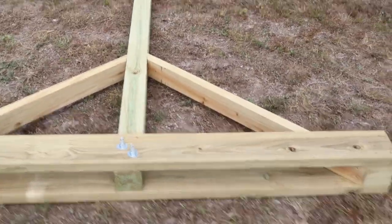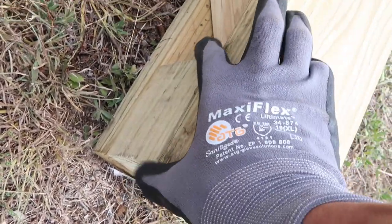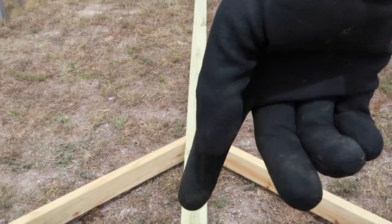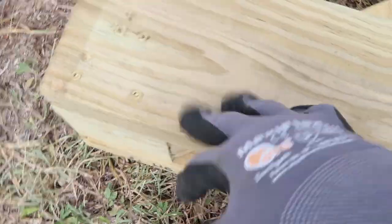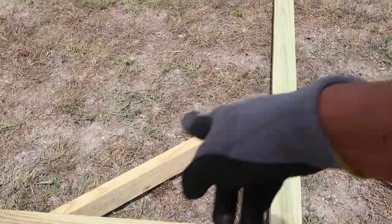So like I said, these are the main bases that we built at home. Two 2x6s that are each 6 feet long. And then we have a piece of 4x6. I think it's like, I don't know, 4 inches wide, that we cut off of the main top beam and placed on either corner. And then we have a 12-foot 4x4 going up the middle. And then we just placed the wood screws, 5 of them here, 5 here, 5 there, and then 2 lag bolts through the 4x4 in the bottom. Then, like I mentioned, the 42.5-inch support legs.